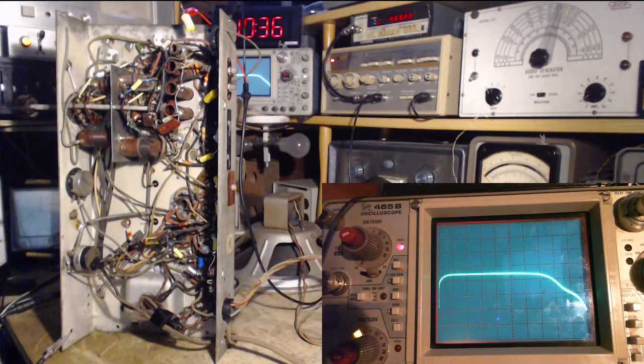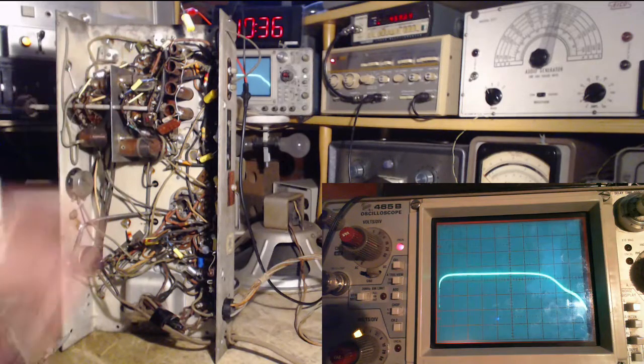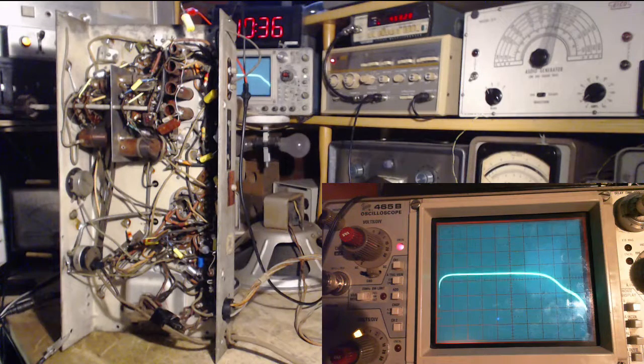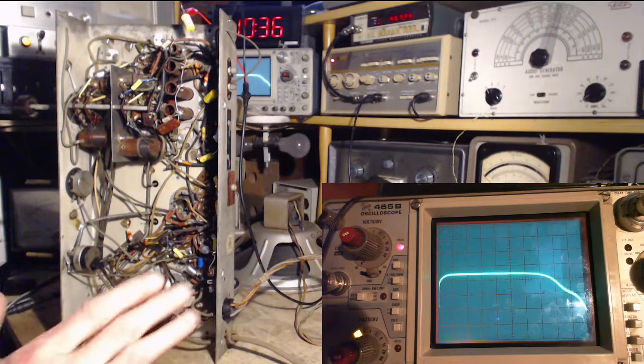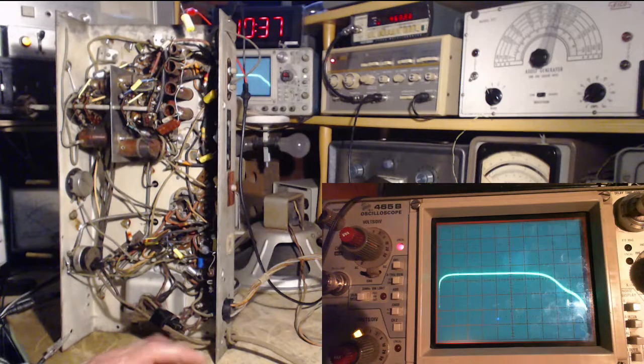I think it's less likely the IFs would be affected by that, and much more likely that the other adjustments would be affected by it. All these coils. There's coils in here that have like a resting point, if you like. And you put this plate on and the resting point is moved a little bit. I guess we can think of it that way. Let's worry about that later. What we've got to worry about is the IF appears to be way off.